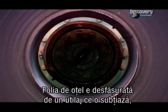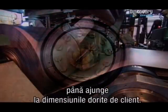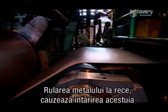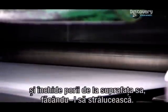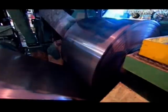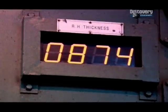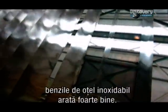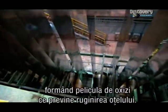They now unwind the steel into a machine that rolls it thinner, so that it's exactly what the customer ordered. Rolling the metal when it's cold also causes it to harden, and makes the surface pores close so it shines. One last cleaning, and the stainless steel strips look spectacular. The chrome in the steel combines with oxygen in the atmosphere to form that oxide film that prevents it from rusting.